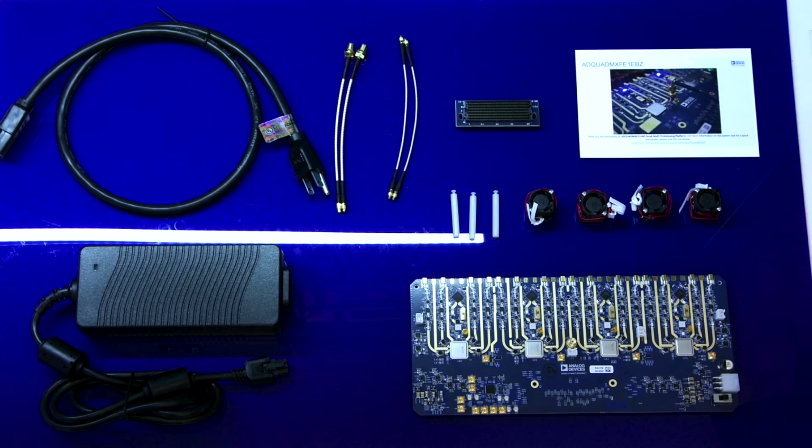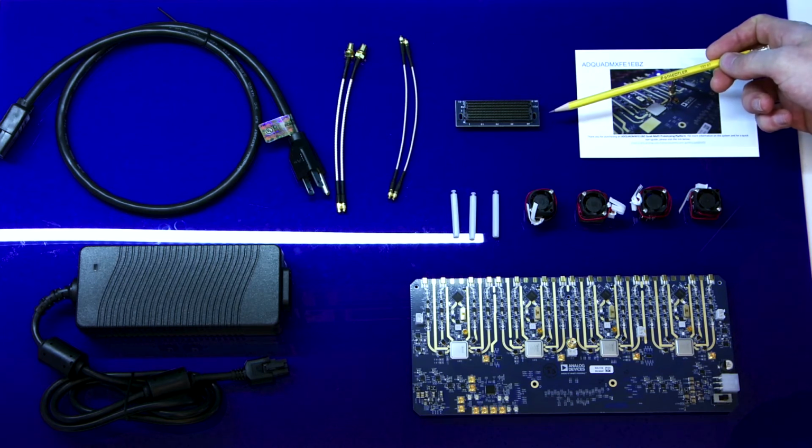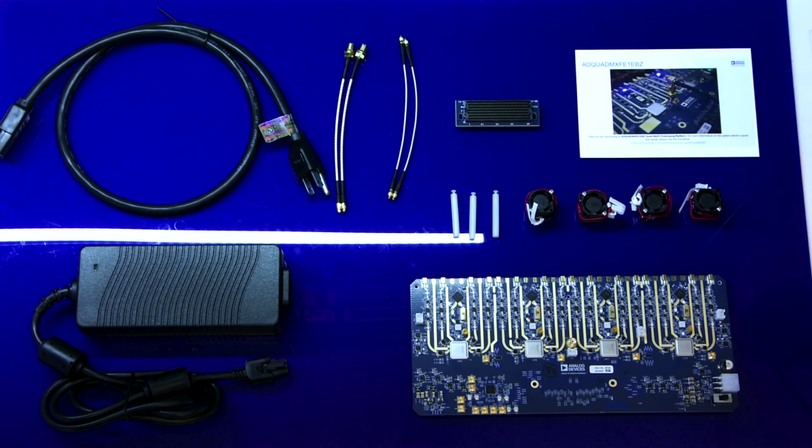A software reference design including FPGA HDL with JESD204B and JESD204C cores and an embedded Linux image. A MATLAB add-on and control interface including example application scripts and a customer GUI. An FMC Plus connector to interface to a Xilinx VCU118 FPGA board.